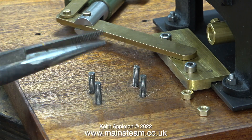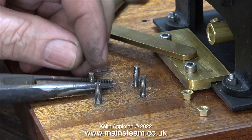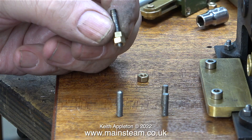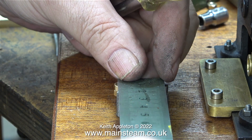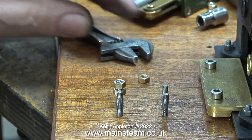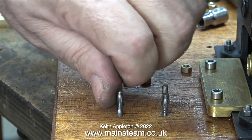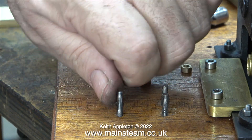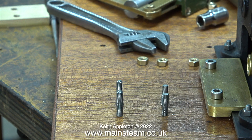In this clip I'm using a pair of long-nose pliers to remove the studs, and as you can see the end of the pliers has marked the baseboard — but that is not a problem because I am not working on a fully finished polished baseboard. When I start the piping operation you will see that more damage will occur. After removing two of the studs I turned them over, fitted two lock nuts, and tightened them into the board with some Loctite 603. After fitting each stud I unlocked the lock nuts with a socket and a spanner and moved on to the next one.